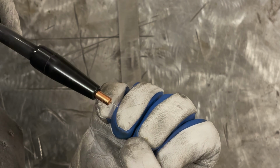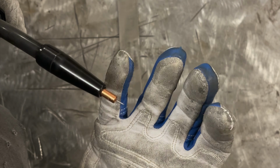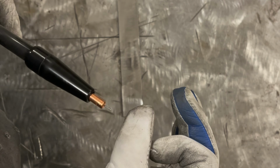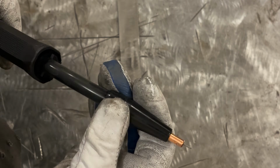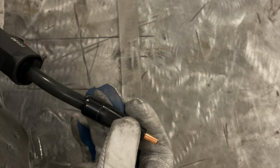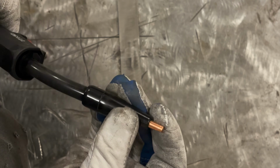And then as it's doing that, the gas is going to escape and push that weld open, and you're going to see what's known as wormholes, where it's a big long channel or holes that are just all over the weld. That's typically only found in flux core wire. Well, that's generally what causes it. If it's not a bad spool of wire, it's going to be an issue with your contact tip distance.